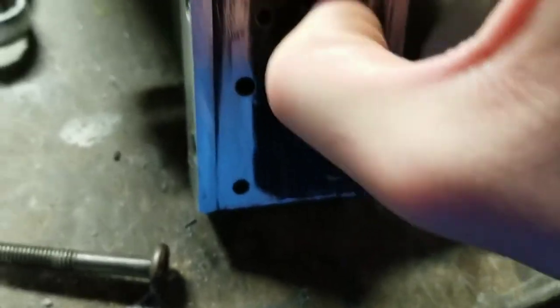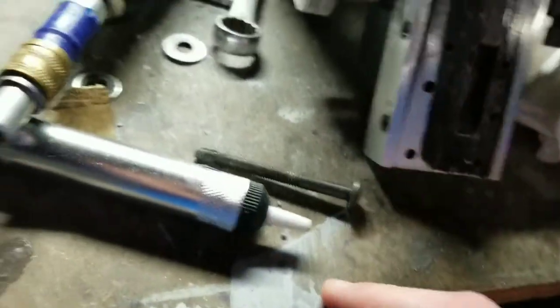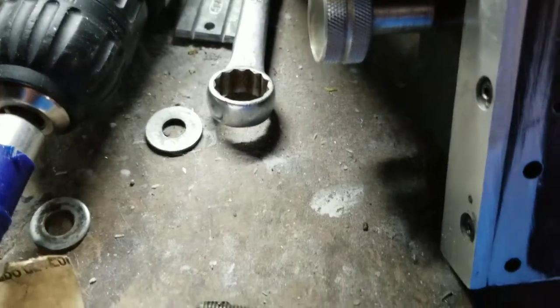I bought the JB Weld two-part epoxy and this stuff works great. I redid the connection down here with JB Weld and it's way stronger — it snapped off with just super glue, but it's about three times as strong with JB Weld. To prepare the JB Weld: get a Q-tip and a water bottle cap. Mix both halves of the compound in roughly 50/50 proportions, then use the Q-tip to mix it. After you're done, spread it onto the surface, making sure it's not touching the surface next to it because it'll bond pretty much anything.